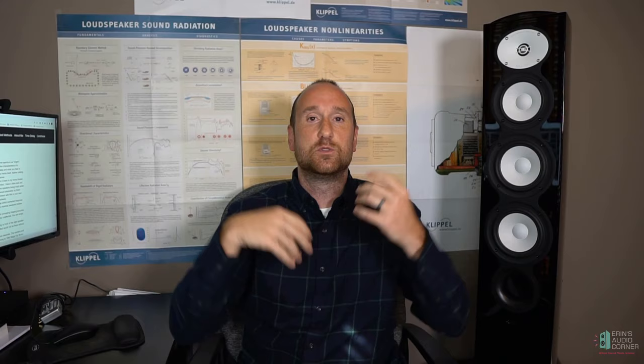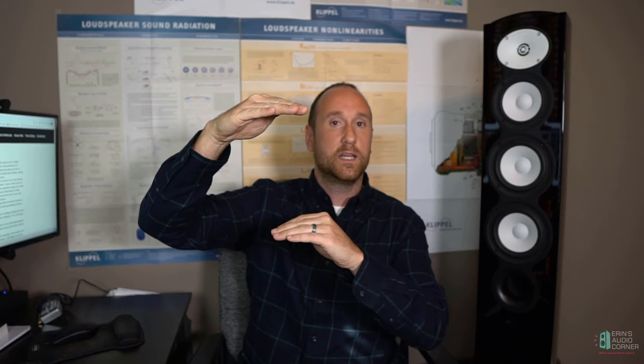So you're not catching the full sound. It's almost like it's compressed or clipped. You've got a waveform, it goes up here, but you're chopping it right here. And you're saying, nah, you're done there. With this speaker, it does a very, very good job of allowing you the extra dynamics that you don't normally get. Now that's certainly attributed to the extra sensitivity, because most speakers this size, and obviously bookshelf speakers, are going to have a lower sensitivity.